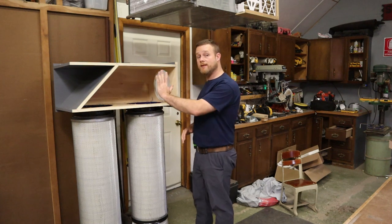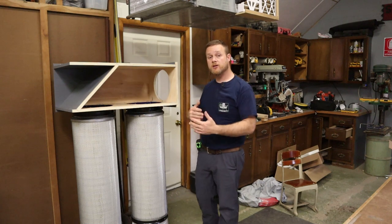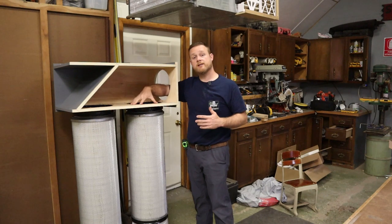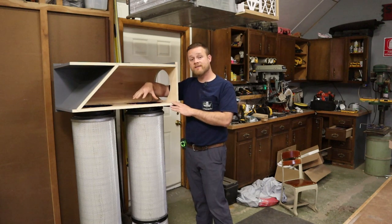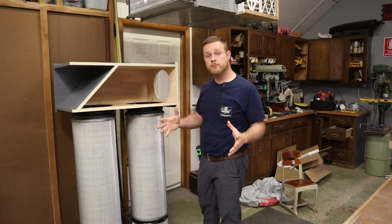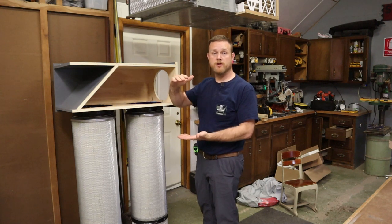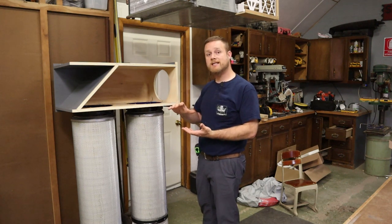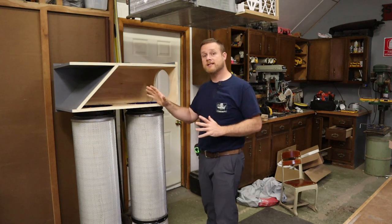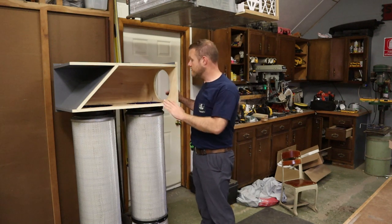There's one more step before we add the front face. Wynn Environmental recommends lining the inside with carpet — not thin indoor-outdoor carpet, but real good thick quality carpet — for sound attenuation. This can result in a 5 to 8 dB reduction. For those who don't know much about decibels, for every 10 dB you add in noise level you've doubled the noise, so a 5 to 8 dB reduction is quite significant, especially in a small shop. This is going inside a mechanical room on the side of my shop, but I still intend to do it.